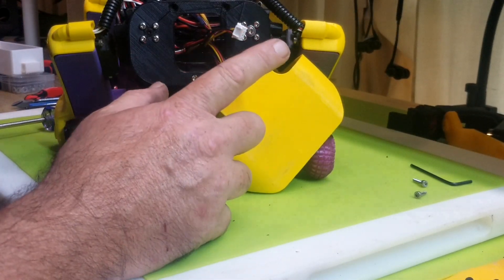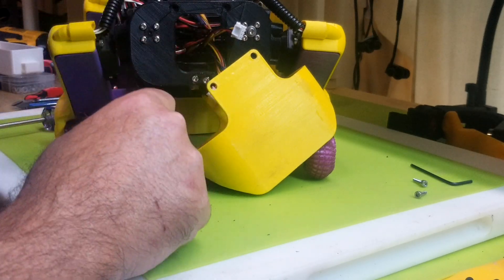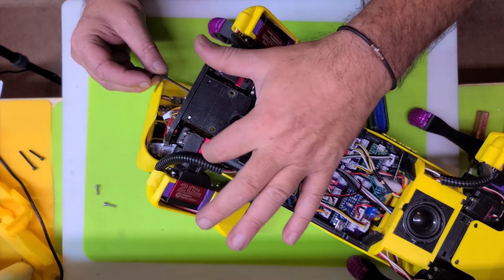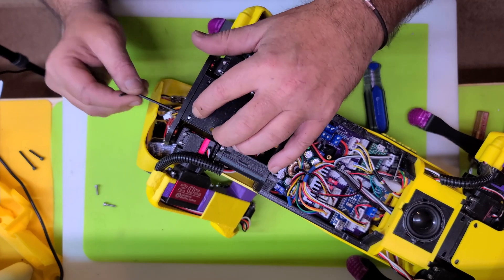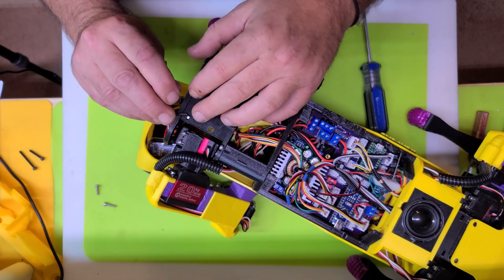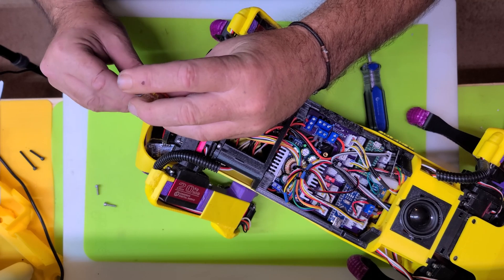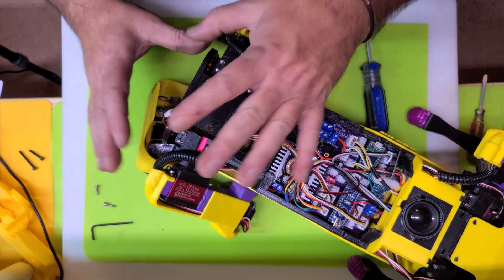So this is one of the reasons why I do not like these embedded nuts — I have a problem now with this one here, the nut is slipping, so there's no easy solution. I'm going to try and open this up enough to get my motor out. A couple of solutions: you can heat the nut up again and take some sort of tool and crush the plastic around it to hold it tight. Another solution is to get a tiny screwdriver, wedge it into the nut to hold it in place, and then undo it. But yes, that's one of the design flaws of those embedded nuts.